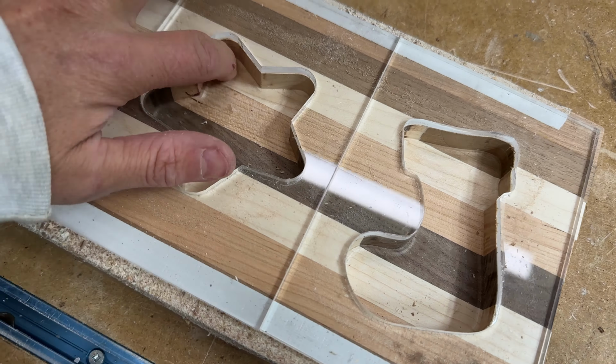I decided to add a little extra border to the top using some more scrap wood. First, I trimmed this wood to the size that I wanted, which was about 1/2 inch wide. Then I cut 6 pieces with the same 60-degree angle, and the miter saw was once again set to 30. Now note that the length for these are the same as your actual hexagon pieces. So for me, that was 10.5 centimeters. These pieces were all glued to the top, but you could also use brad nails if preferred.